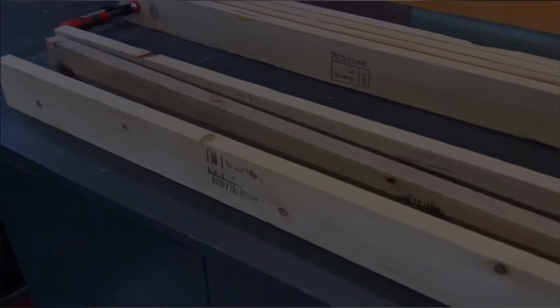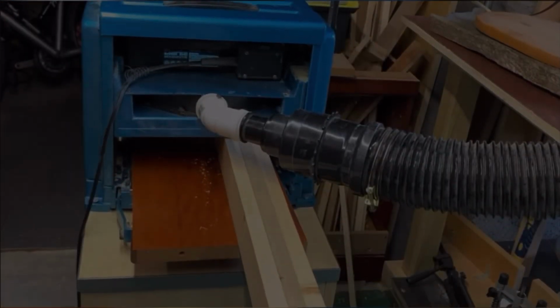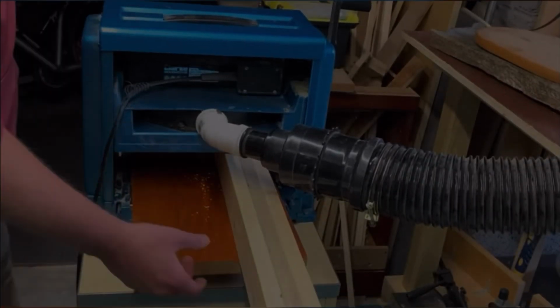We all know how to break down a pallet. You just take whatever tools that you've got and break that thing down. Doesn't have to be pretty. All you need is some usable timber at the end, in whatever way that you can. Once I've busted this pallet to pieces, I like to clamp the ends together and then I can buzz things through the planer. This helps keep everything straight and square. Make sure I get a consistent finish each and every time.